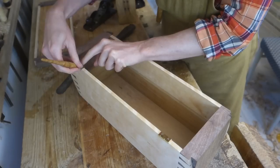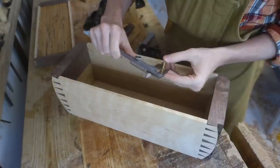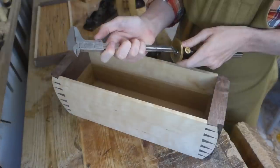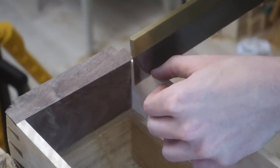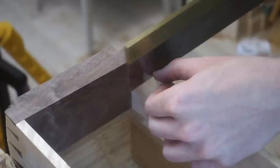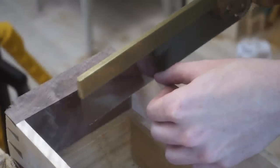With that drying, it is time to hinge the lid, first marking their positions, then measuring the thickness and scribing half the depth with a marking gauge. I made a bunch of saw cuts down to the depth and pared it out with a chisel.